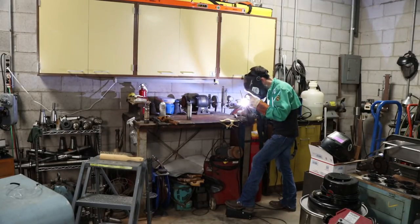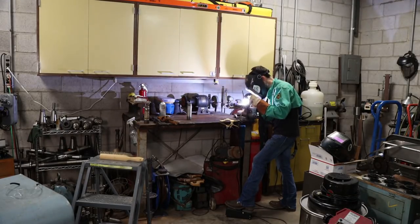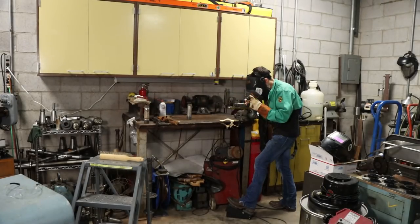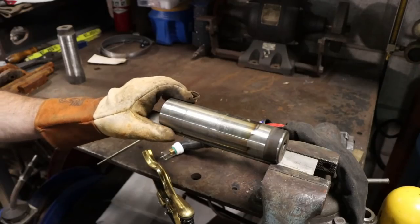These sockets are not going to go into a case at the Smithsonian — they're going to go into a working man's tool bag. All I'm doing is welding these things up so the weld bead is proud of the socket, taking it over to the belt sander, knocking off all that proud weld, making it nice and smooth, and then giving it a paint job.